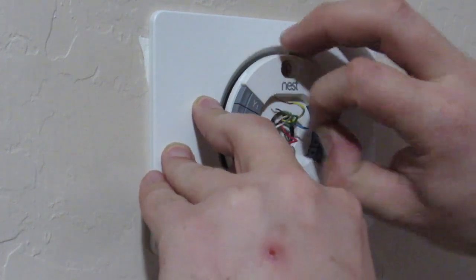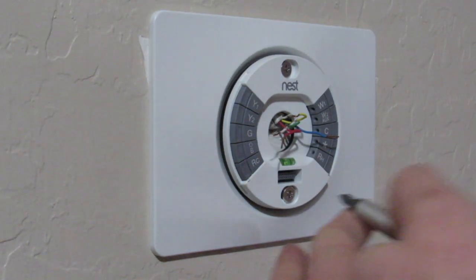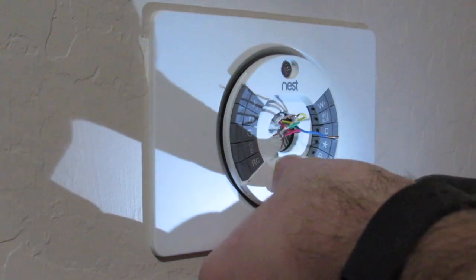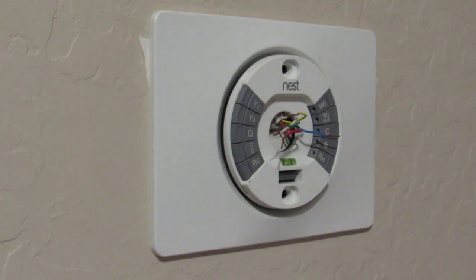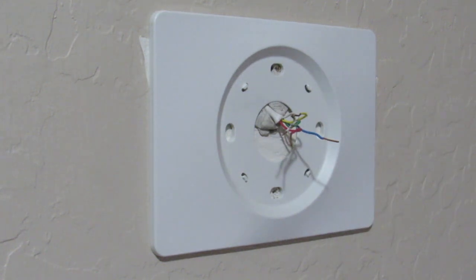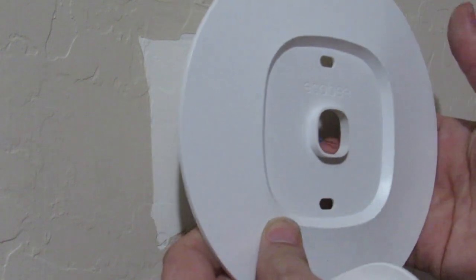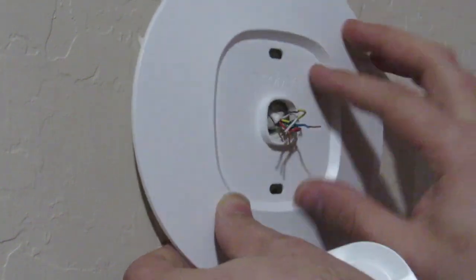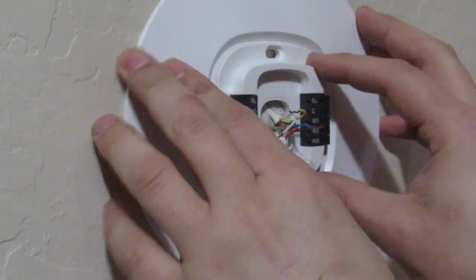Starting with the blue wire, once you've got them all disconnected from the thermostat, go ahead and bundle them up in the middle so you can pull the outer housing out. Then I go ahead and use the power drill to remove the screws top and bottom, and the old Nest thermostat bracket pops right off. We take a second to pull off the outer plate as well, and we reveal that the painters did not take my old thermostat off the wall when they painted. So now we put the wires through the larger plate first to cover up as much of that unpainted area as we can.